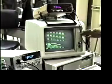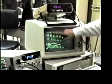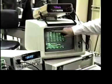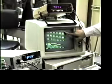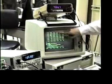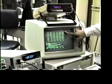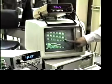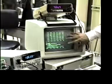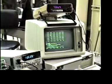Well, now we can see the measurement result on the screen. We have 6 channels, 3 channels for the deflection signal, 3 channels for the loading force signal. And each row means the measurement for each experiment. So this way we can have the results of many experiments, and then we will use these results to calculate the stiffness matrix of this machine tool.